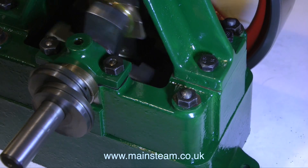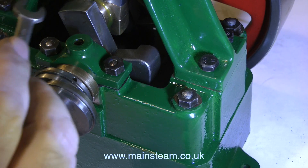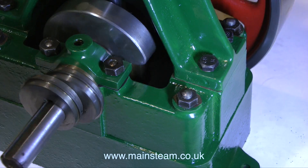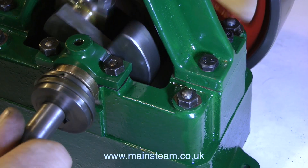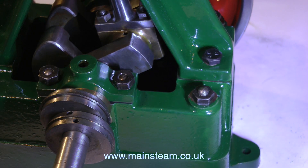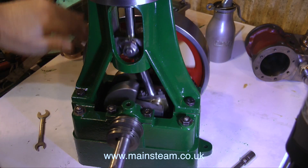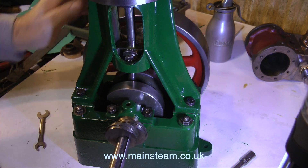From now on, this is more of an art than a science. It's done completely by feel — at least that's the way I do it — to make sure that everything is okay. If I tighten up the big end and run the engine, it will eventually wear slack, but it is likely to score the bearings, or worse than that, seize up, and I don't want either of those things to happen. So what I'm going to do now is just rotate the crankshaft with the flywheel, and you will see that even after a few revolutions, it starts to feel freer. Some of this is due to the fact that the main bearings are not tight either.